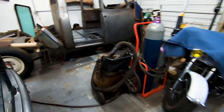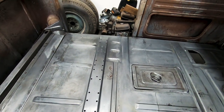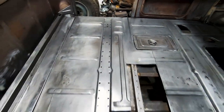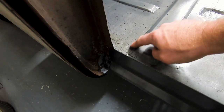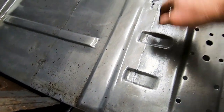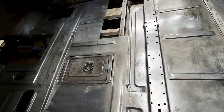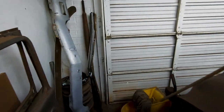Let's go back and look at the other side that's already done. You can see that same piece right in here — that whole section — you can see the little three notches just to the left of it. That's where the seat platform comes up. So here it is on this side. Here's what we've got to do: we've got to close this end. On the other panel it's open right here, so I hammer this down and close it so that it looks more like the finished side. Then we'll go through it and put these other notches in. We've got a bead in it so that everything matches up on that side — I've actually got two ribs over there to make it match up. So we've got some stuff to make.